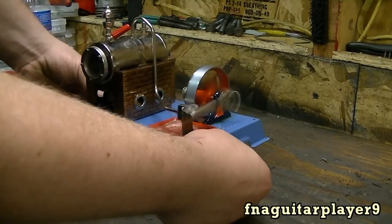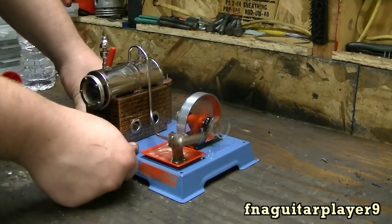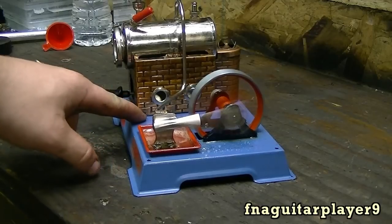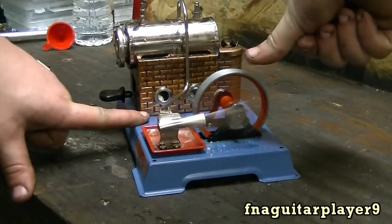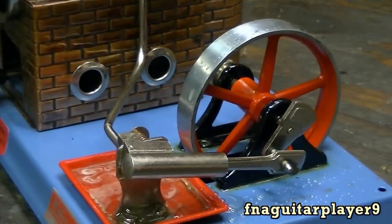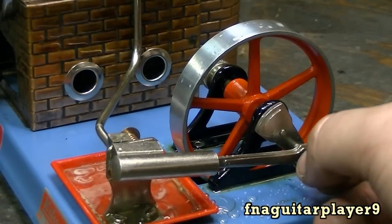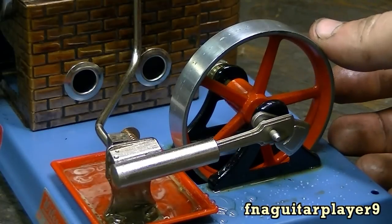It's actually not that noisy — you're just hearing a lot of vibration off of it clanking on the workbench. If you want to stop the engine running, you're either going to let some pressure off the valve here, or you can take your thumb and slow it down like that. And it's not a dual-acting cylinder — it's a wobbler steam engine. If it was dual-acting, it would pull over here like this and start on its own.